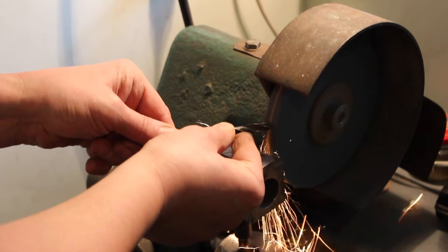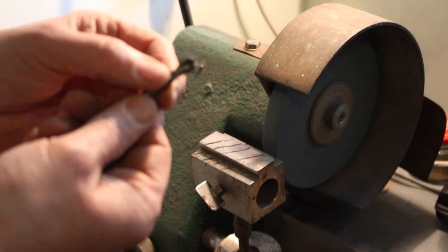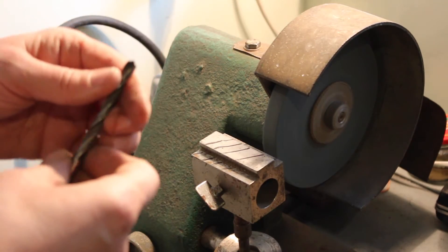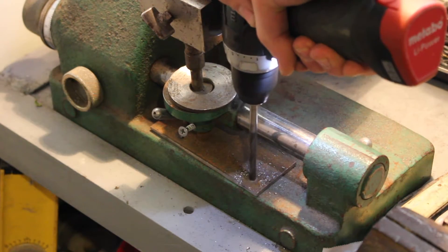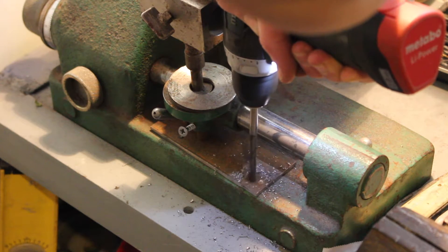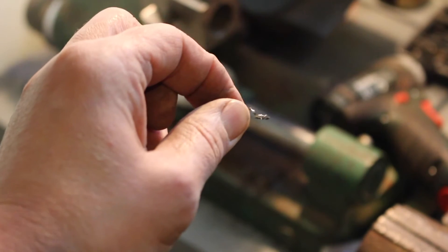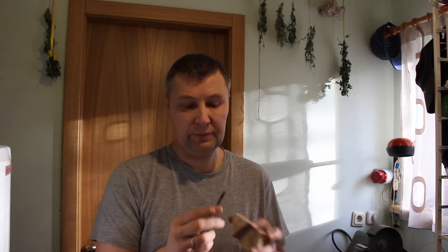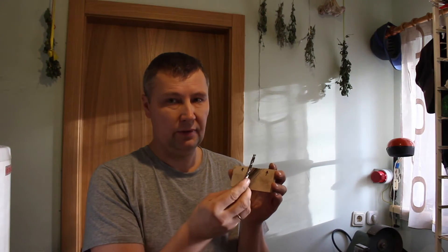Check the angle, and up. Check the angle. And now we can check — it's all ready. If this side is long, this means it's a good side. Hey guys, today we learned about sharpening the drills. Remember the angle: 59 degrees. Then push and up, again push and up, and be higher than the center. See you again, bye!